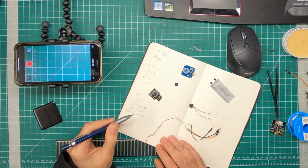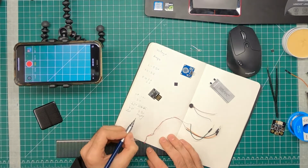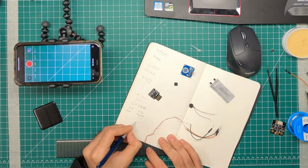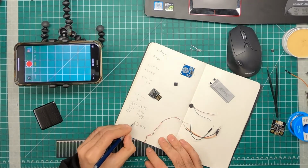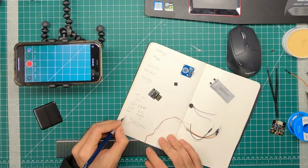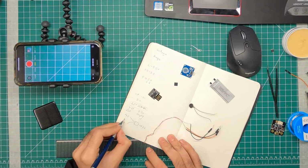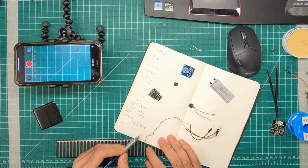So what you want to devise is an intermediate device that no matter what voltage you put inside it, will always give you an output of 3 volts. So this is your device. It will always give you an output of 3 volts, and you have an input range with a high value of 4 point whatever, or anything, and a low value of 3 volts. Whenever we put in 4.2, it will still give out 3, and everything in between down to 3.2 volts, this thing will put out 3 volts.